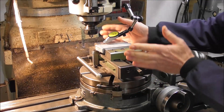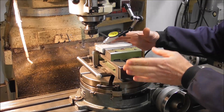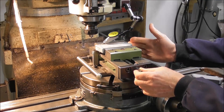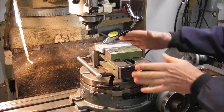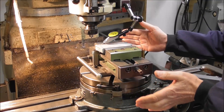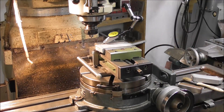That can be a good option for this type of part that has opposing parallel surfaces. I've done a video on how to modify a conventional vice to make it tiltable — I think it's called 'Incline Your Vice.' It's a simple frame that bolts on the side of a vice and lets you tip it up at any angle you like, then lock it up with a couple of cap screws.